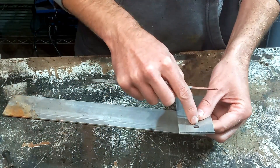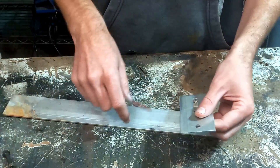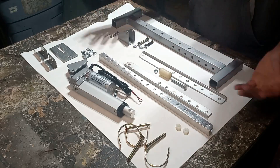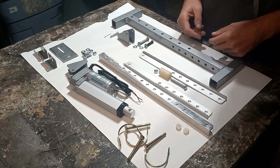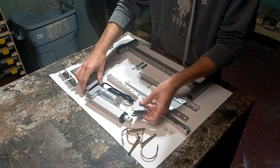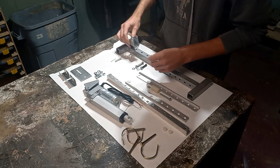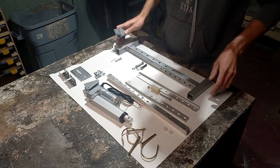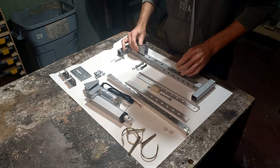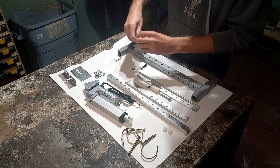Similar with this backer plate — just a piece of eighth-inch by two-inch wide, three and a half inches long. Drilled a hole, then a series of holes, opened them up and used the square file again to get a square hole for a carriage bolt. Now that we have all our mechanical pieces cut out, we start the assembly. With the linear actuator kit it comes with these two end brackets which we're going to reuse, and our welded up and painted frame — we're going to just arbitrarily put this in place.